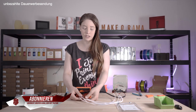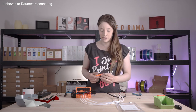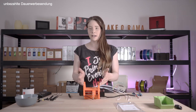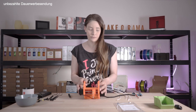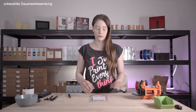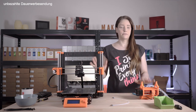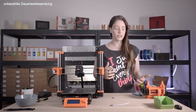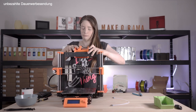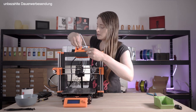As you can see, I have now assembled the MMU to the point where the PTFE tubes are screwed in and secured to the bracket. In the next step we need to secure the bracket to the frame. Once the brackets are attached to the MMU, the MMU is fully assembled. In the next step we need to prepare the remaining PTFE tube to connect the MMU to the printer. We have upgraded the printer from MK3 to MK3S, built the MMU, and prepared the PTFE tube for connecting both components. Now we mount the MMU onto the printer, and then we can connect the two components with the PTFE tube.